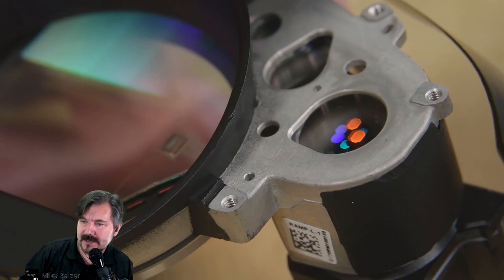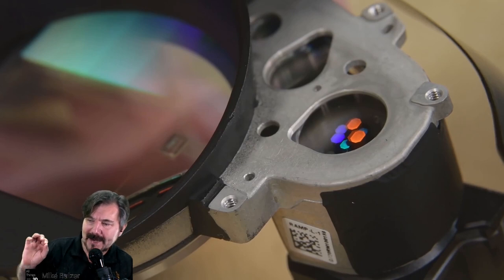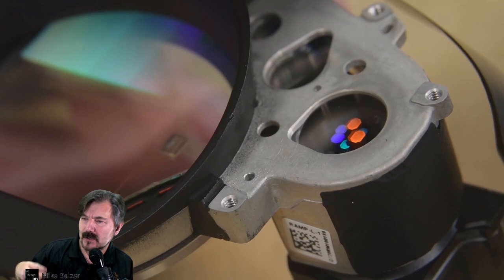One of the other things that helps improve the performance of your vision processor is taking some of the information from some of the positional sensors and basically running them through a small CPU, crunching it, fusing the information, and providing — like in this case — 3D depth. It's basically SLAM generation without having to do it on the CPU, which then obviously offloads it. This is something very similar to what Qualcomm is doing with the Lenovo Mirage Solo as well as the HTC Vive Focus — they offload that SLAM capability to an auxiliary chip, which reduces the load on the processor itself.